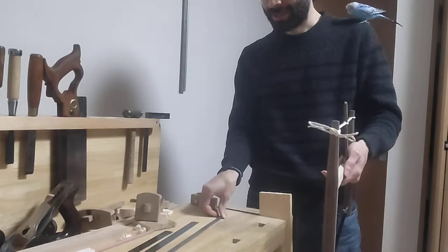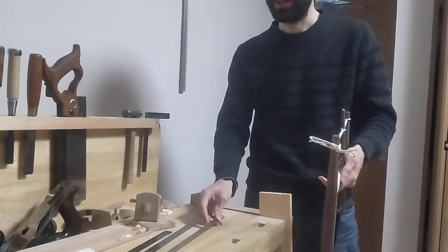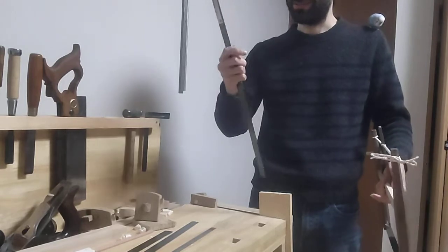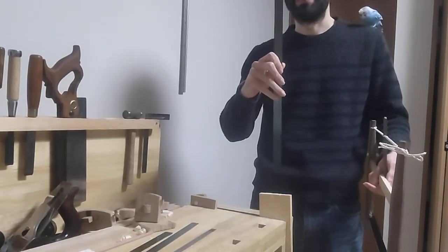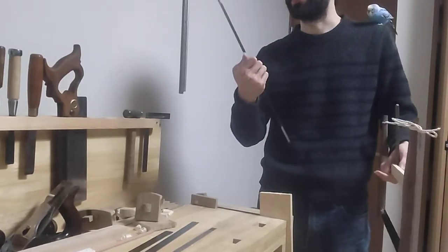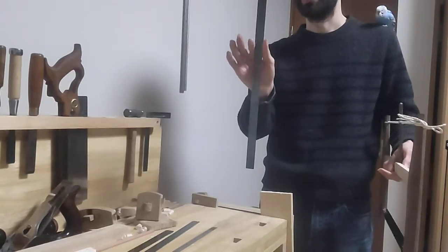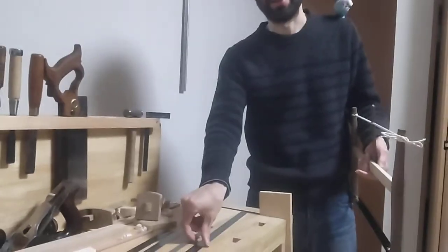They're usually only half an inch at most in width, and they have too much set and often too aggressive teeth. So I recommend finding some steel. Now, in Japan, we're, for some reason, really lucky that you can buy this spring-tempered SK5 steel. This is what commercial saws are made from here in Japan, and I don't know what they're used for, these strips, but you can buy them in these strips which are half a millimeter by 20 millimeters, or roughly three quarters of an inch in width, and they're perfect. You can also get them thinner than half a millimeter.